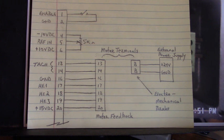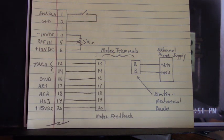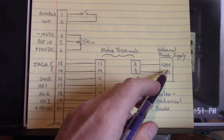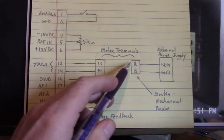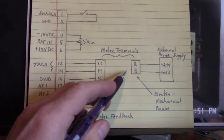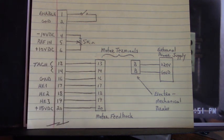This drive had an electromechanical brake to hold position. Usually when you have an electromechanical brake and a motor, it's holding position so that that axis does not drop from gravity. From an external power supply, I applied plus 24 volts to the B terminal — that's where the brown wire is — and ground of that external power supply goes to the blue wire of the servo motor terminal board. That's what we need to make that Perma-Drive servo motor run with the Perma-Drive servo drive.